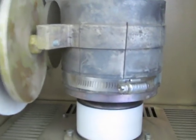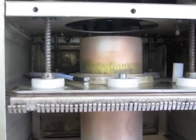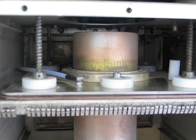There's the exhaust going outside the building, and there's the chimney that is at the high voltage. Now that whole plate that I keep passing by — that whole plate can move up and down. There's the part where the chimney attaches to the top of the tube. Boy, that tube gets hot — the air exiting there is probably 160 to 180 degrees Fahrenheit. The tube is throwing off a fair amount of heat doing its job amplifying. It amplifies an input of about 225 watts and jumps that up to about 3,300 watts — a little more than times ten.